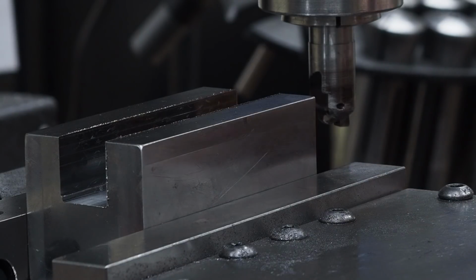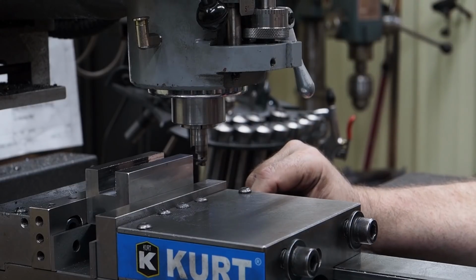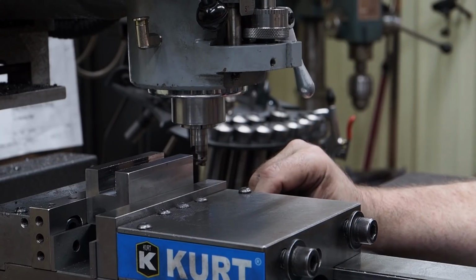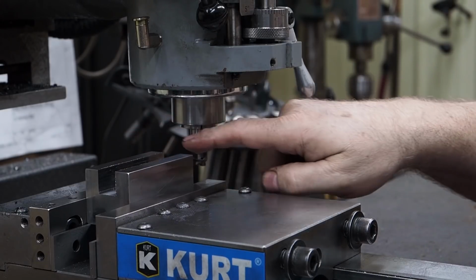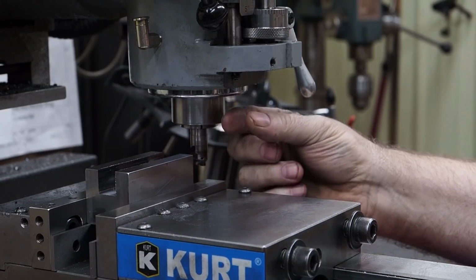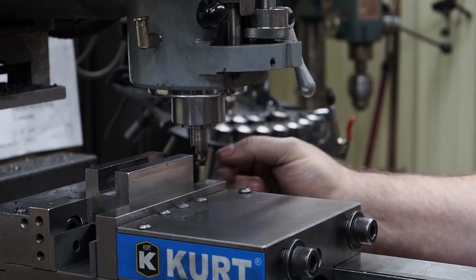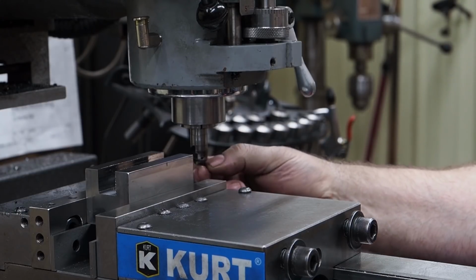One of the things when you're in a channel cut, you want to cut your feed rates down. You want to be conservative, because you got a full contact cut. The insert's working really hard. And one of the other things that happens, if you go straight in a channel cut, drop down, straight back, drop down, straight back, pretty soon these walls are building up. As you get deeper, you start rubbing with your insert all the way up and down.